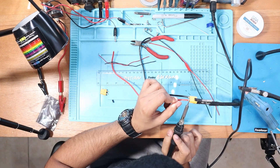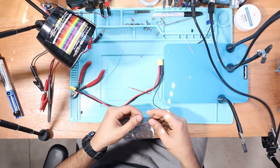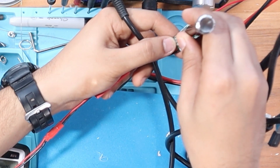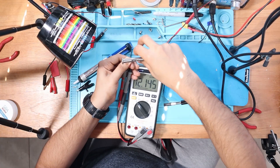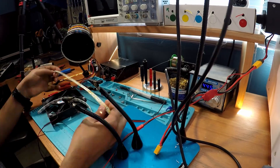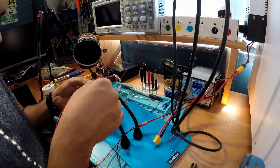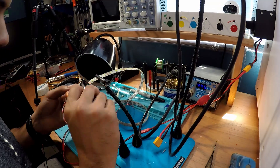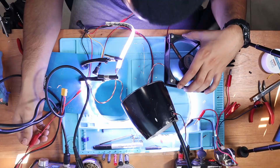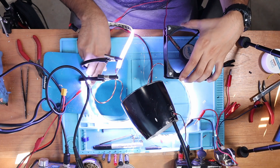Using a smaller pair of scrap wire I made a tap-off and soldered it to the respective pins on the buck converter. Using a small flat-tip screwdriver and my multimeter I set the output of the regulator to 12 volts, needed for the LEDs and fan. I then wired up the switches, fans, and LEDs. For the LEDs I cut the strip into 12-inch sections and ran wire joining each one to the other, using lots of heat shrink and headers to keep the wire management neat. I made sure to test everything before moving back to the enclosure.